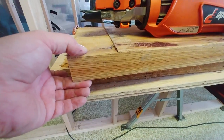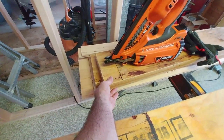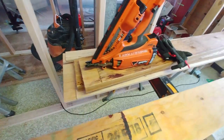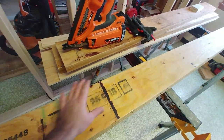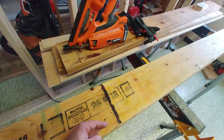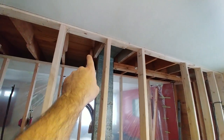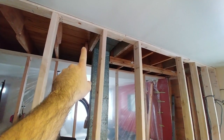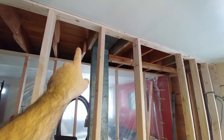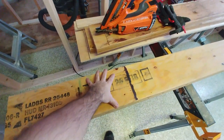It's an inch and three quarter dimension — very usual, that's most common. And when you're talking about what size you need to do a span, we're talking about its height, or this dimension shown here. This is seven and a quarter, just like our two by eight ceiling joists. It's a nominal two by eight, and it's an actual seven and a quarter. And this is a seven and a quarter.